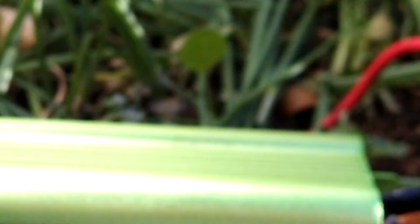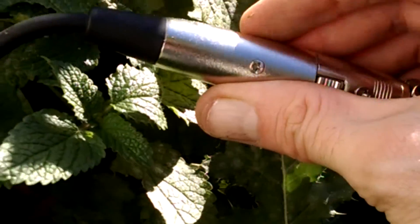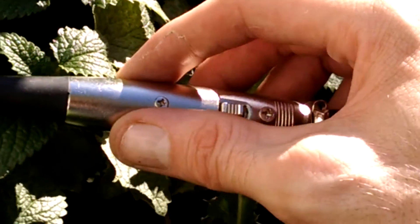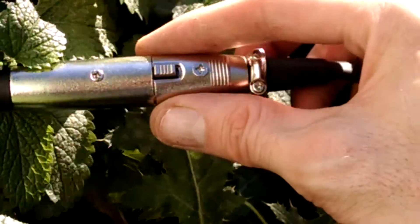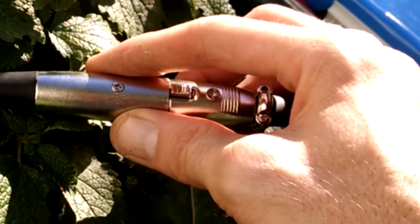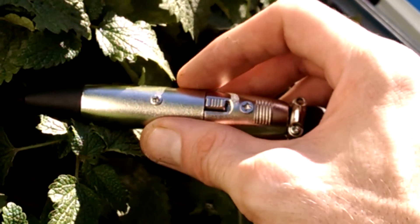What the deal is, I used a standard XLR cable because that's the type of connector my bike battery takes. But I didn't realize it was not wired to the standard configuration. The XLR uses pin 1 and 3 for positive and negative — pin 2 is ground. And my bike battery uses pins 1 and 2. So the whole time I had my ground and my negative switched.